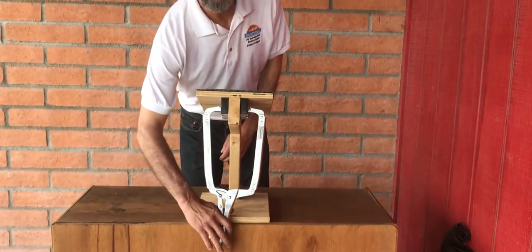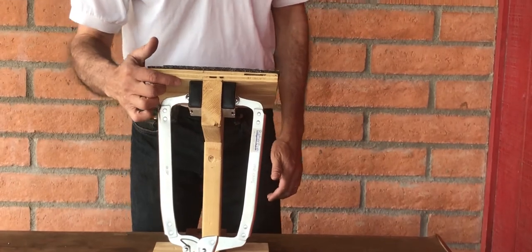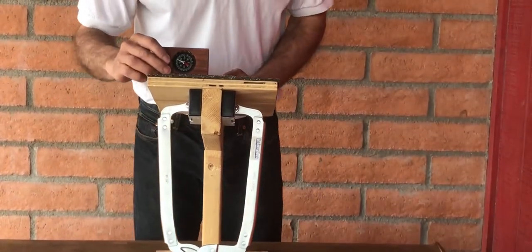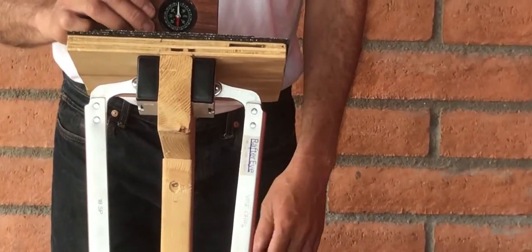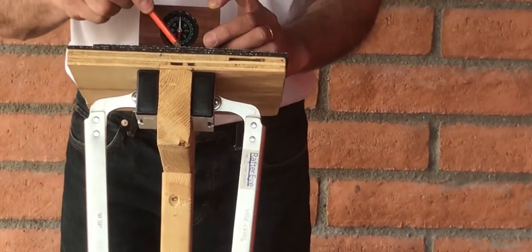The RE1 is simple to operate. Just clamp the magnet blocks to the rafter immediately below the roof deck. On the rooftop, hold the compass upright and perpendicular to the rafter. When north points straight down, you've located center. Make a mark and you're ready to attach.